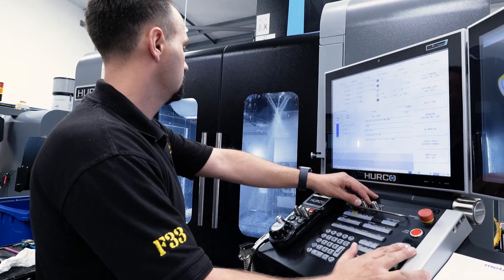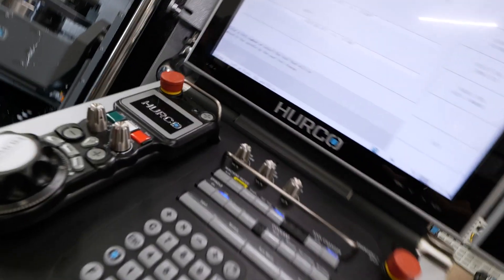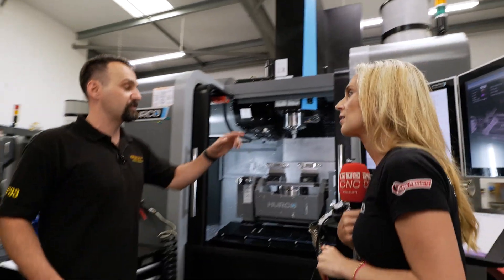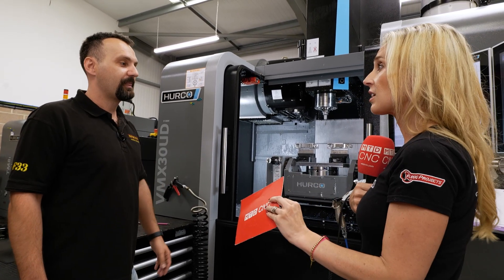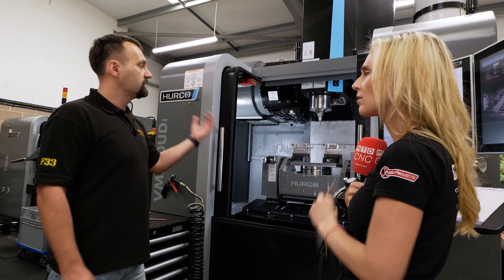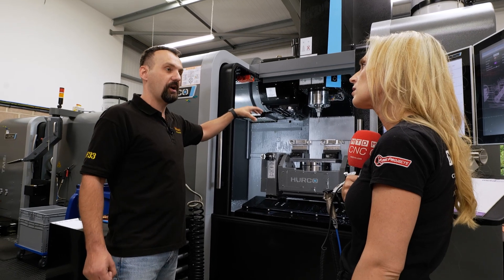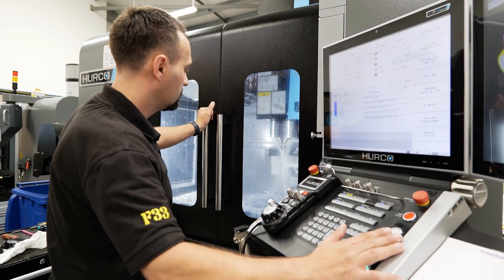The magic interrupt button — it's such a simple feature. We can press that button at any time the machine is running, jog it to any position we want, and simply press Auto, Green Cycle Start, and the machine will resume like nothing ever happened. Other brands don't do this to this extent. It benefits us because we can change the cutters, we can change the inserts on a face mill. Once the machine is halfway through cutting the part, we can restart it through the middle of the ISO code on this machine as well.